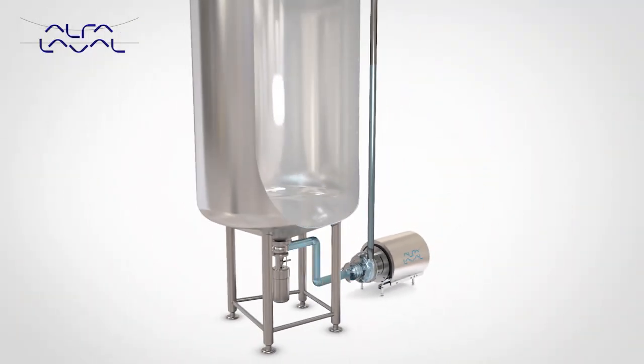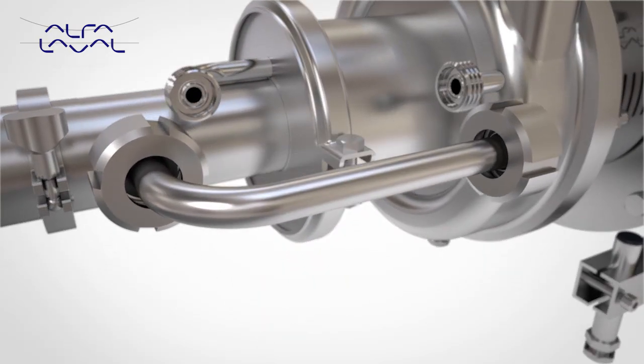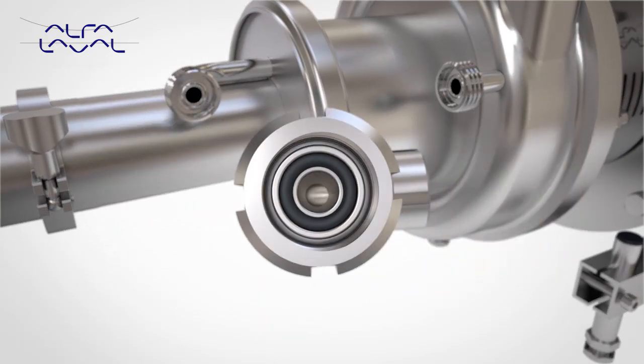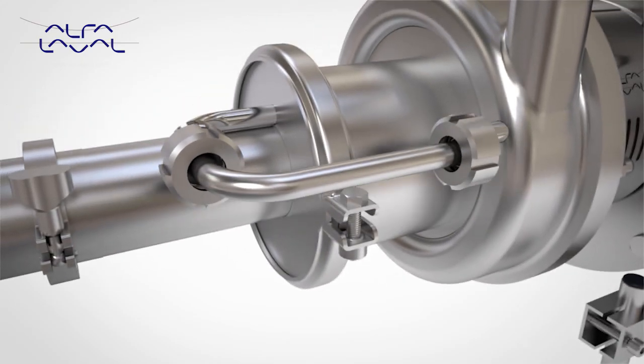Piping design should be configured to retain liquid in the pump to enable prime upon startup. Designed with only one bend, this allows full visual inspection of the recirculation pump pipe, thus conforming fully to 3A requirements.